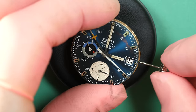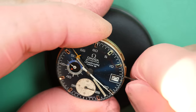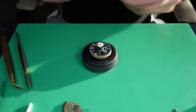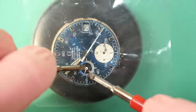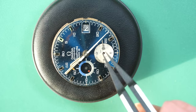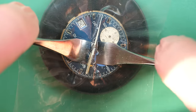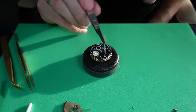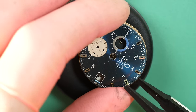It's coming out of the case. I just bought a winding stem and a crown that fits, and I will try to align the hand. But you see, it's not working very well — something is broken inside as well. We'll have to figure it out later. First, try to remove the hands, starting with the small ones. That's the hand from the chronograph, the second running hand. I'll put them aside with my carbon tweezers just to make sure I don't damage the dial, even if it's a bit damaged. Now I try to remove the center hands — quite a lot of hands on this watch.